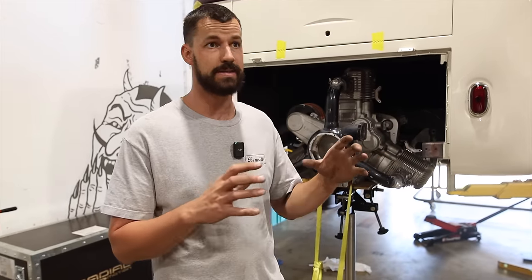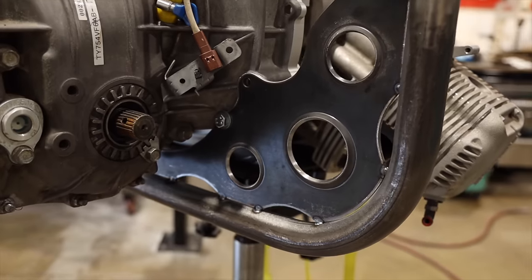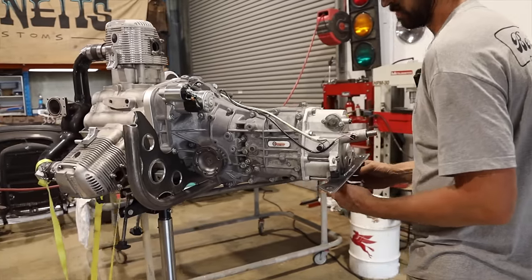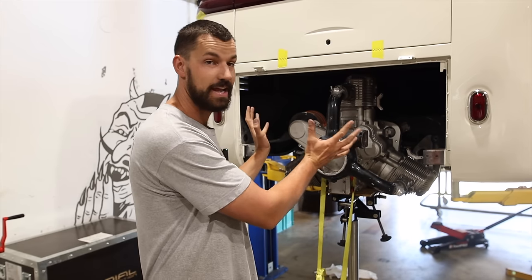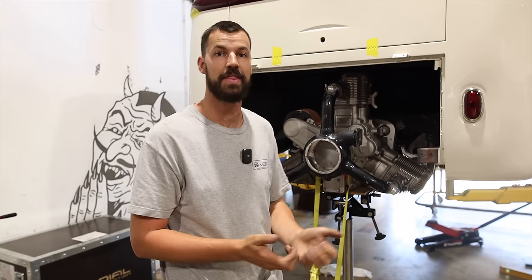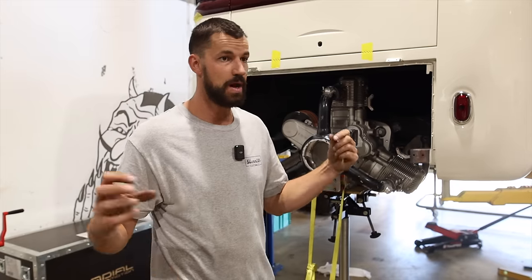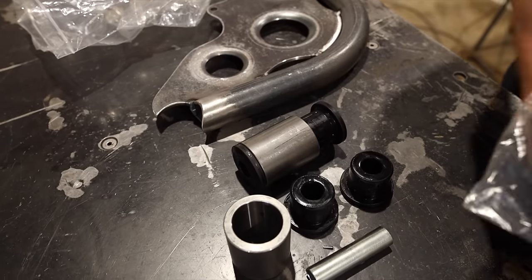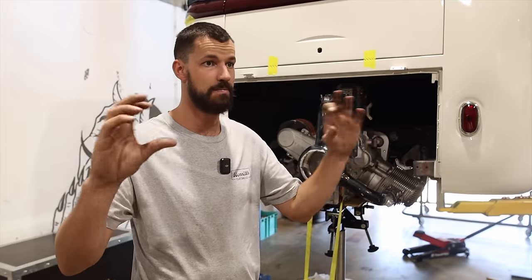We are going to create some recessed boxing plates that will end up being the foundation for our motor mounts, in order to get this bolted in and remove the transmission jack, just letting it sit there with that cradle that we fabricated. So we need to get the cradle on the table, finish weld that up, and get our links or our bushings mounted on. Then we're going to start to figure out how we're going to create these recessed boxing plates.